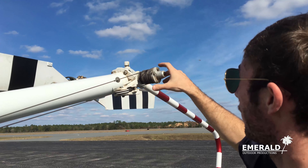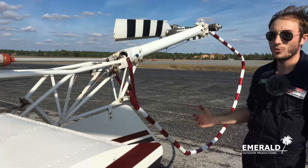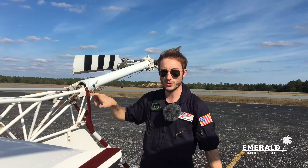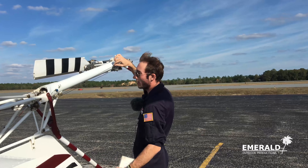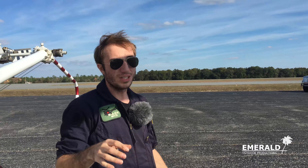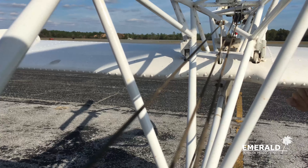At the stinger, rub on the bottom to make sure nobody hit it hard. Then at the tail rotor — feel if there's grease in the little boot, check the pitch links, make sure the weights are still secured. Look down inside each blade, then rotate the blades so they're horizontal, grab them, and push them forward and backward checking for play. Then check up and down for play in those blades — it's important there's not too much.